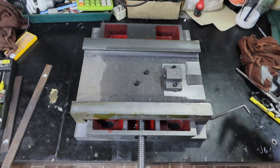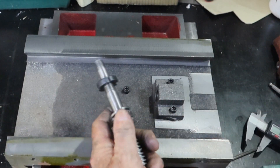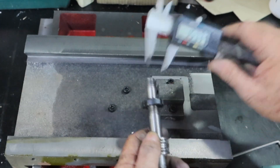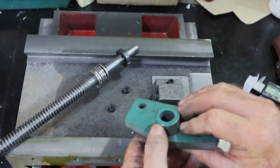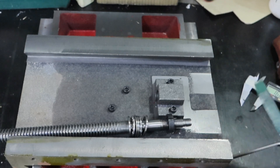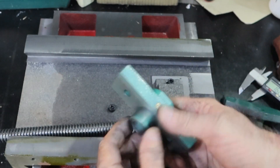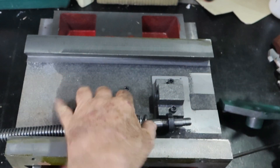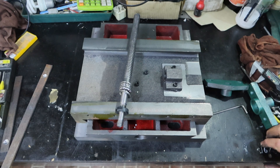There's quite a nice machined surface on there. It's a weird size though — 14.8mm — what's that? It might be 9/16th but I doubt it because this is a Chinese metric machine. So there's a bit of meat in here that's just been rough bored. If I can find a bronze bush that I can bore out without taking too much out of it, and then bore the center out to fit this, I'll get all that up-and-down slop out of it. This is all machined here so I'll be able to do that in the lathe with a boring bar — just put the chuck in and bore it out. This is actually the front one — same size hole. Not when it flops around though: 15.7 versus 14.7 — it's a millimeter bigger. How ridiculous.